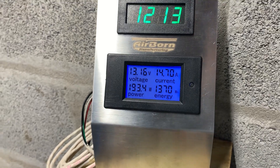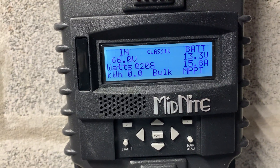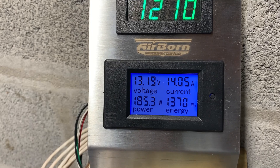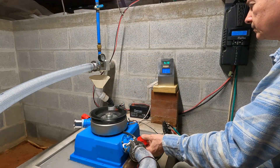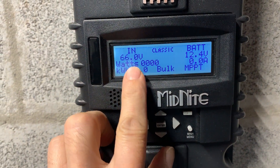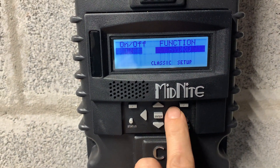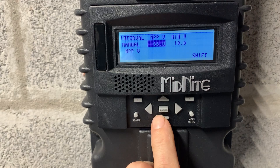It's got it at about 190 watts. So it should be higher now. I thought it was better at 58, but at least in this case it looks like higher voltage will yield more. We're only at about 190 on my gauge and we want to see just over 200. Let's increase it another four volts. So that's the 66 I set it to — it's interesting how it holds that input voltage. It seems to be back-feeding somehow. Let's go into setup and change the voltage to 70.